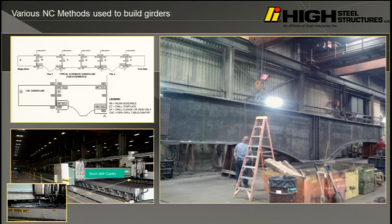The camber is generated from our CAD-CAM group from the drawings. All of you who are into BIM, right? You transfer that single source data model that goes upstream to design someday and downstream to fabrication and erection. All that same data, the cambers don't change, and they have to be re-input and re-input and re-input. We're at the point now where we could actually have just assembled this and hoped that it would fit, and it probably would, given the tolerances that we held.